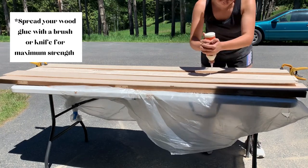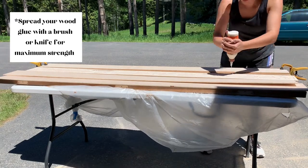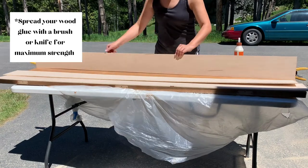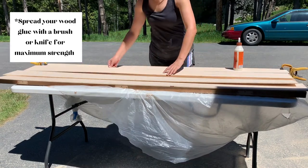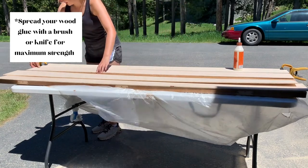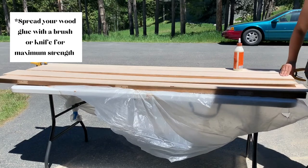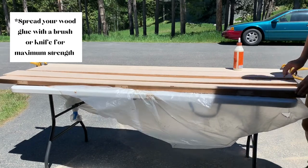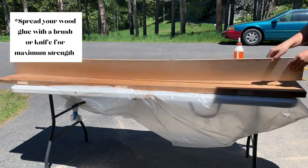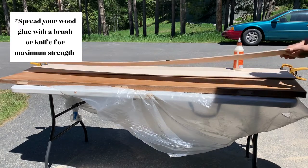Brad nailing will help secure it a lot more, but since these are hollow core doors, the only solid wood is around the border, and this is the only space you can nail into. Though I would never say this is a bad idea, if you are staining the doors, you would need a stainable wood filler to cover the holes from the nails, and I found that my stainable wood filler actually stained darker than my panels. You could try to make your own wood filler from your maple sawdust. Certainly, if you paint the doors, the nail filling process would be a lot simpler, so I would definitely consider that as an option.